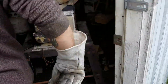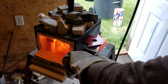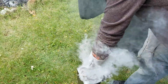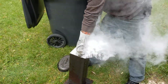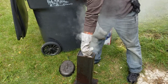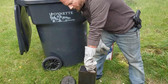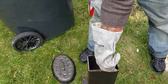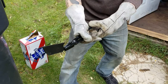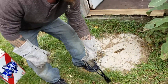We're going to grab the other one. Check for non-ferrous — it's not sticking. More quench. I always try to wait for the bubbling to kind of subside, the smoke to go down, and I figure it's about ready. That one's perfectly straight. We're good there — that's beautiful.